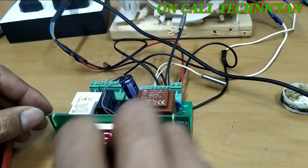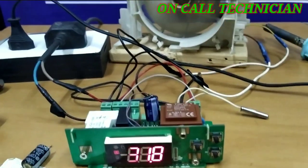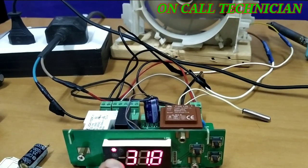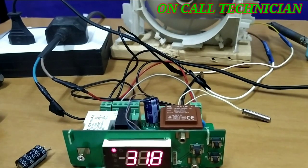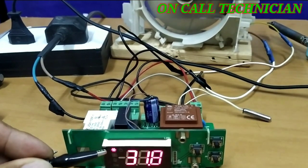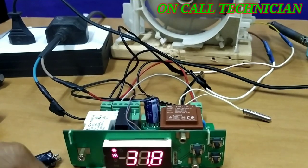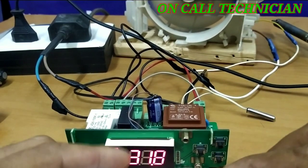Installation done. It's working — the fan compressor is activated now. The symbol is for the fan compressor and it's not blinking anymore. Let's wait for the fan motor to activate as well. In order to activate the fan motor, I'm going to connect the evaporator sensor.